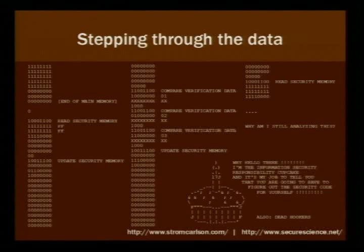Here's the security code presentation: read the security memory, update security memory, then compare verification data — byte one, byte two, byte three — update security memory again, then read security memory. If done correctly, the security counter resets to three and you're set to go. Stepping through the data, here's the answer to reset, the first bytes of the header, the read main memory command, then it starts dumping everything out — header, value, timestamp. Many thousands of bytes later, you find the security code presented three bytes in sequence. I found it.